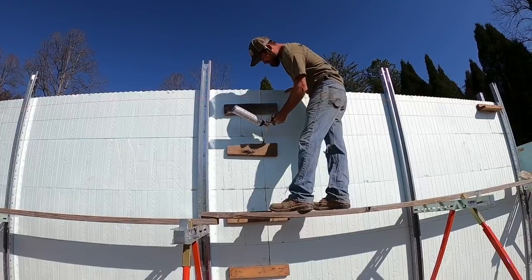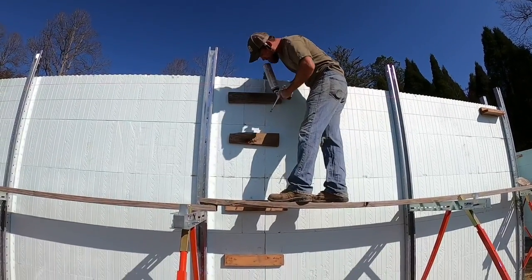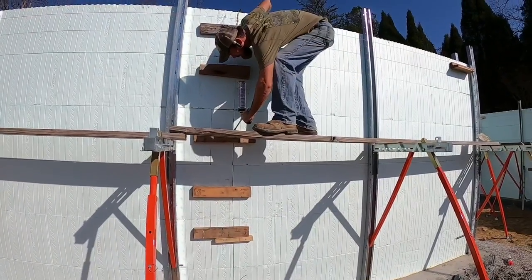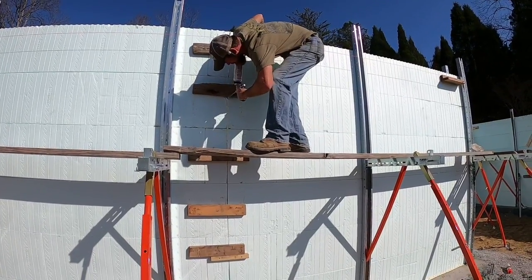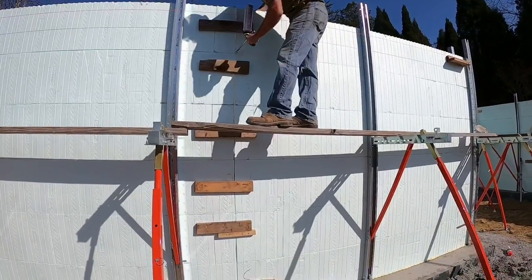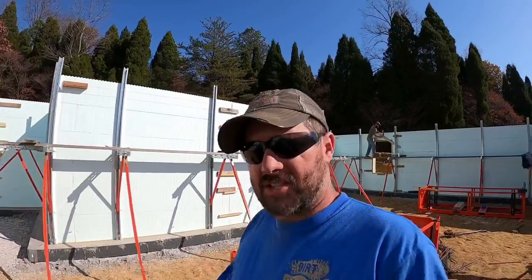All right, so the last thing to do with those commons before we pour is going through and foaming them. We always foam them last. That way, if you need to make any adjustments to them, you can, and you're not fighting the foam. That common there is extremely tight. That's a tight one. All right, so now that the commons are all in place, everything's strapped off,